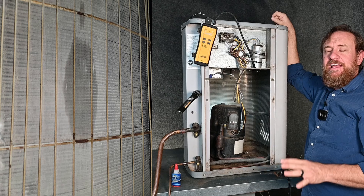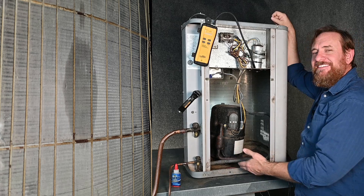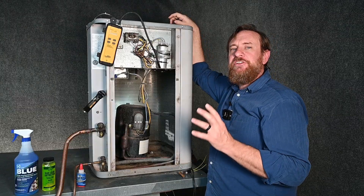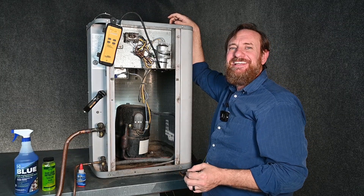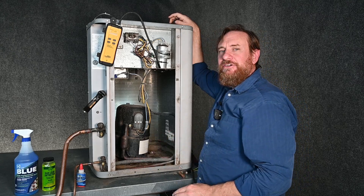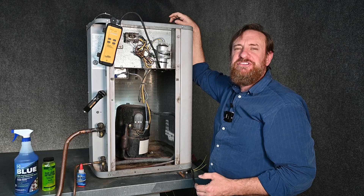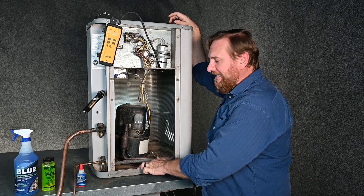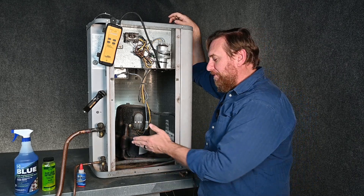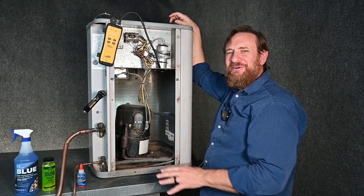Now it doesn't mean that there's a leak there. It could simply be on a new system where they had oil, somebody spilled oil, or there was a previous leak. Maybe they were changing the condenser fan motor and spilled the oil — there are several scenarios. So just because you see oil doesn't mean it's a leak, but it should immediately be a thought in your mind that you need to check it out. Now if you find there's not a leak in that location, you want to make sure you clean that oil up so the next person — which may be you — doesn't get distracted by it. And if you're brazing and you hit that oil, it can flare up on you, so cleaning up oil spots is always a good idea.